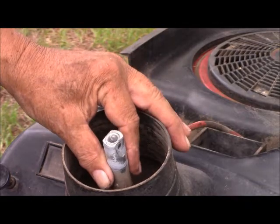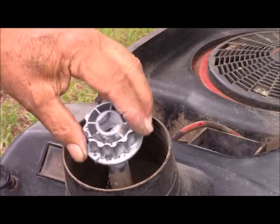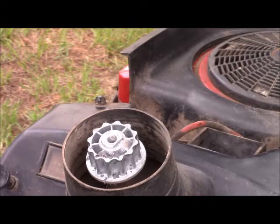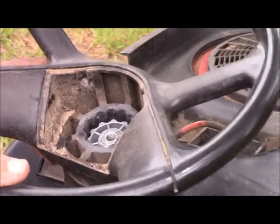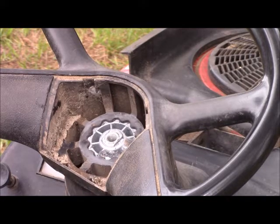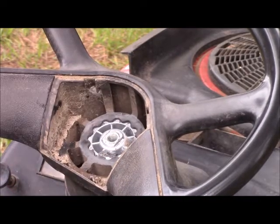The major problem is actually play in this shaft itself. Although this fitting is loose itself, and that I can fix, but that's not solving the major problem. So we've identified a problem in its source, but not solved it. One quick correction would be to put a piece of rubber compressible material here, which would bind against the other parts.